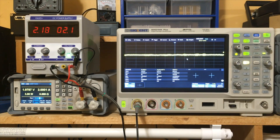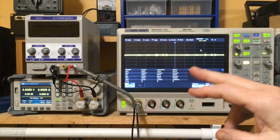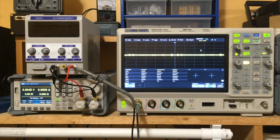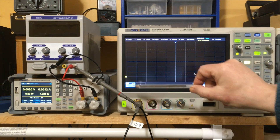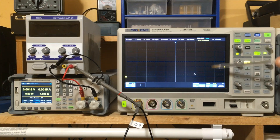We're at about eight millivolts of noise now. I've turned everything off again to check the ambient noise — it looks like things have changed. The ambient noise is now around 7.8 millivolts and about 800 microvolts RMS. I don't know what came on in the lab but something did. Now what I want to do is set up to check the turn-on and turn-off behavior to see if there's any overshoot or undershoot that might be harmful for circuitry connected to it. I've got the scope set for DC input, voltage level at 500 millivolts per division, checking at two volts with a quarter to half amp load, and the trigger set to one volt, about 50 percent.